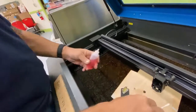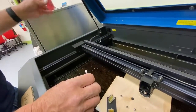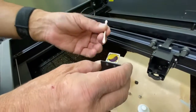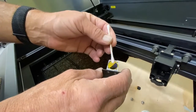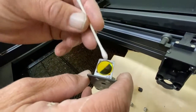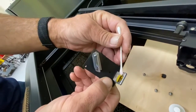For cleaning, we use our lens cleaner and a Q-tip. You can also use microfiber cloth or lens paper to clean it. Take a Q-tip and gently rub over the surface of the lens to clean it up. This one is actually already clean, so you're not seeing any change. Unfortunately, the spot in the center is damage to the lens — it's worth trying to avoid. Clean that surface, clean the top surface of the lens.